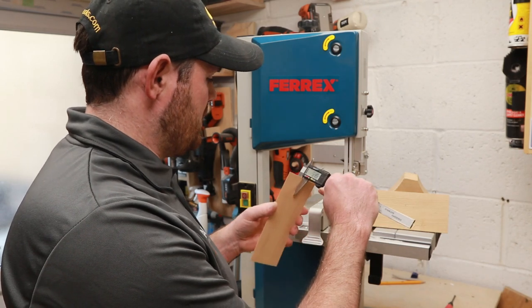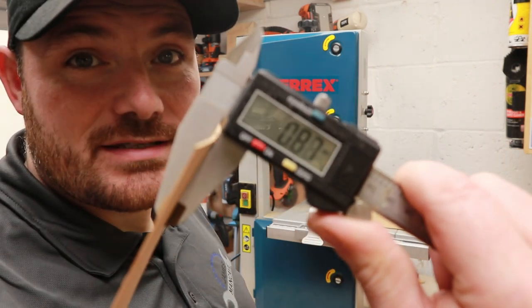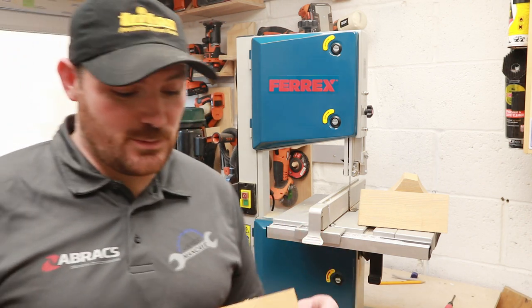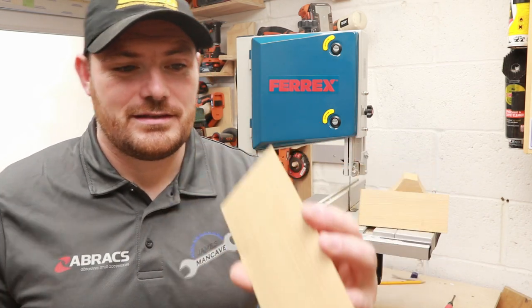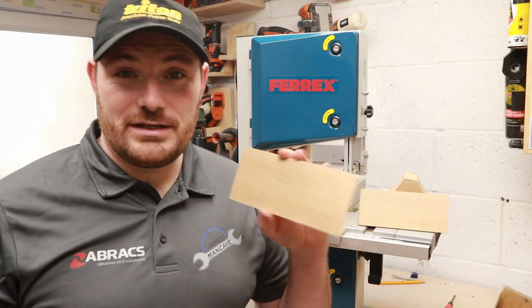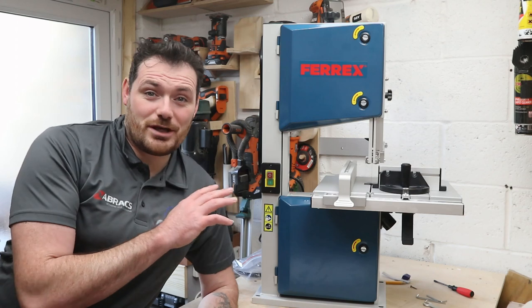So if we measure that bit that I've just cut - wow, it comes out at 0.87 of a millimeter. That is fantastic. I wouldn't have been able to do that on the Parkside bandsaw. This one took a bit of time to set up and the finish left on it is perfect - I'd hardly have to do any sanding to that. But the great thing is now, especially with the extra depth of cut, I can make numerous veneers for all sorts of different projects and that's a really good thing for me. Yeah, really really happy with this one.